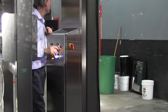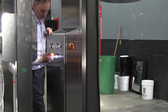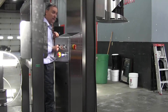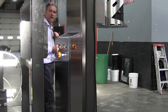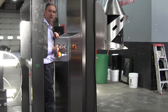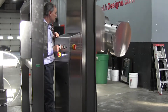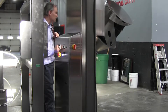If at any point on the way to the load position or the discharge position the reset button is pressed, the machine will stop exactly where it is and you're in dead man mode. In dead man mode, you have to hold and release the selector switch. From there, you can switch back to the discharge position or switch to the load position.